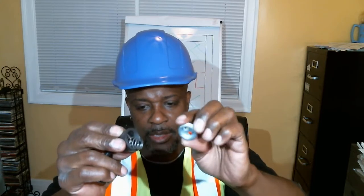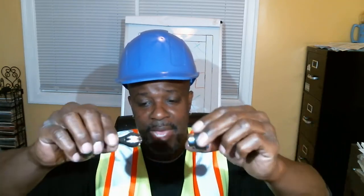They make a couple different versions of this model. One's a clip and the other one's a magnetized. And this is all simple and easy as well. You unscrew this part, screw that into the baseboard, then screw this back in. Then you line up the door where you want it and draw a circle around this part here. Then you unscrew this part that's spring loaded, and you mount this on the door, hopefully in the solid part, and you just screw that back on again. As you open and close the door, that magnet is pretty strong. It'll hold it on there. But this is my favorite one. I've used this one probably about 80% of the time. Depends on the situation.